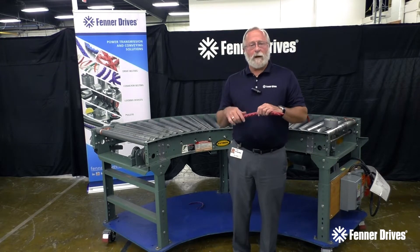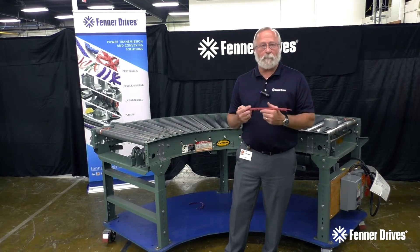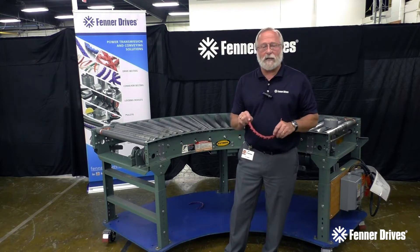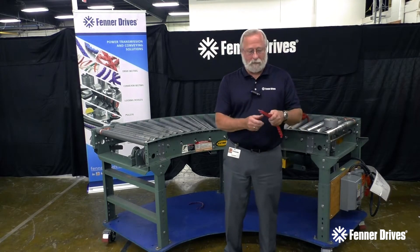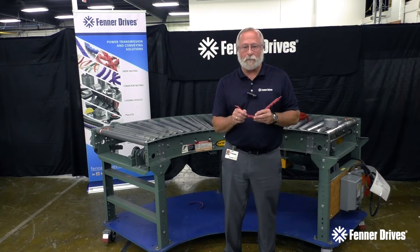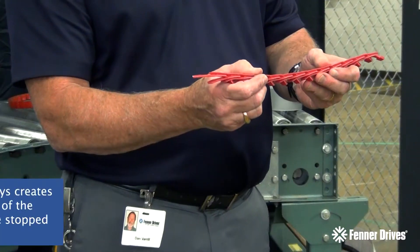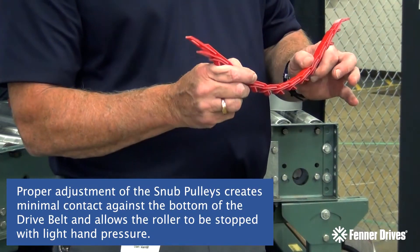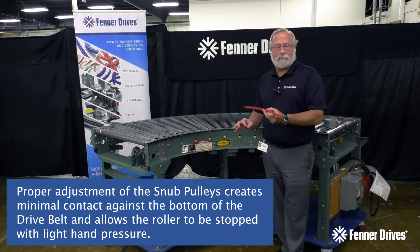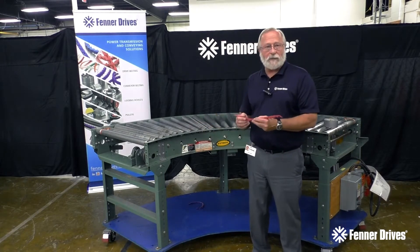Now I'm going to show you probably the easiest and most simple way to replace the rubber belt on your conveyor. Remember, your initial replacement is going to involve replacing a rubber belt. Thereafter, if and when the time comes, you'll be replacing our belt using the same technique — except we'll be taping our belt to the end of your rubber belt. In the future, you'll just engage our links into the belt you're replacing and pull the belt through. One thing we do know is that our belt rides a little bit higher in the snub pulley than the rubber belt, so on the initial application, the first time you install a roller drive, you're going to have to loosen your snubs and drop them down. This is a one-time adjustment.